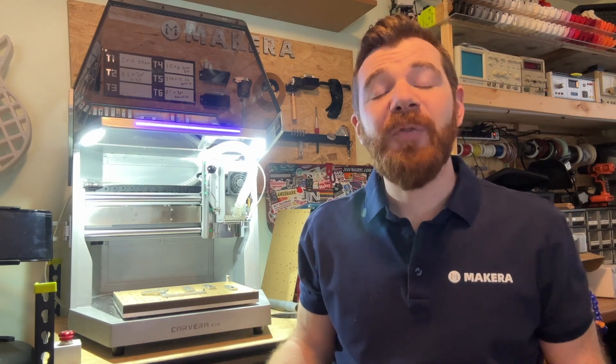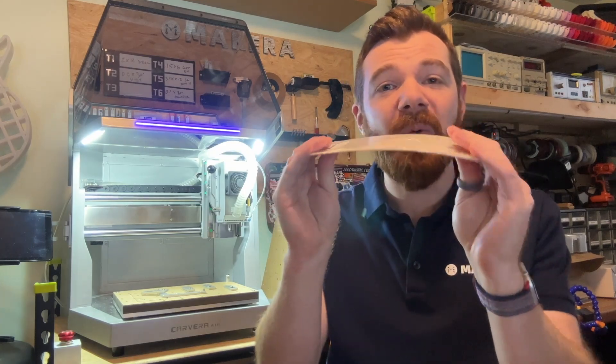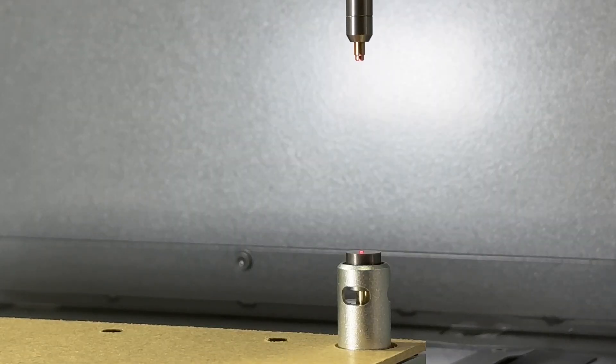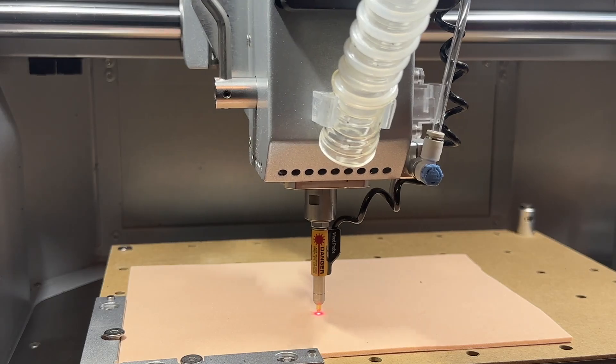This is not only helpful when you're working with a rough piece of material that's not perfectly flat, or something like extruded metal that's not perfectly square, but also when you're working with thin pieces of material like thin plastics that are common to bowing and warping, and thin PCB material which can also start to bow and warp as it sits on a shelf for a long period of time. For all of these instances, Auto Z Leveling will allow you to machine consistent depths despite the discrepancies that you might have in your stock thickness.